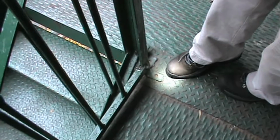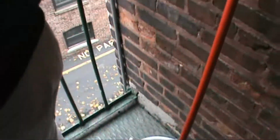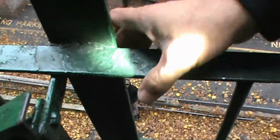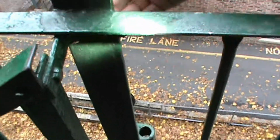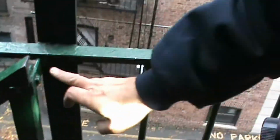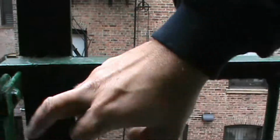Okay? These welded corners and welded connections, you need to bolt them. I can't have a weld on a corner. Rebolt these corners here. Re-cement the pieces there. And whenever there's a reinforcement of any kind that has original hardware, I only have two choices. I can load test it, or I can just change the bolt in lieu of a load test. I'll change these bolts out because this is all original square head bolts on this, so change those out. Change these out.